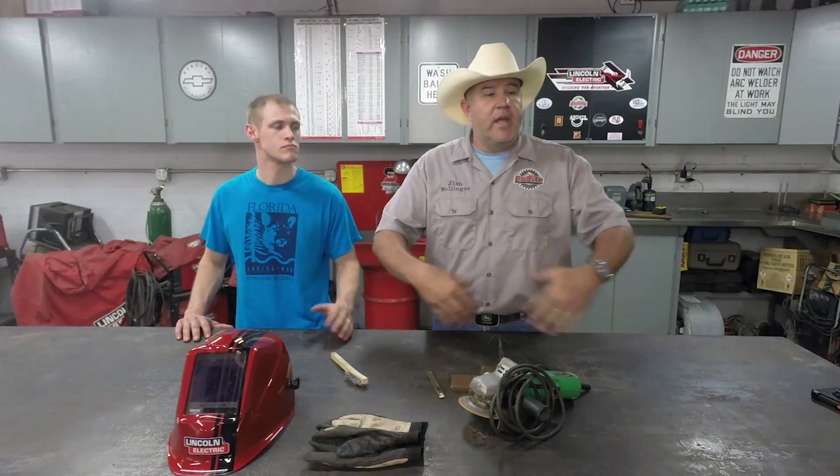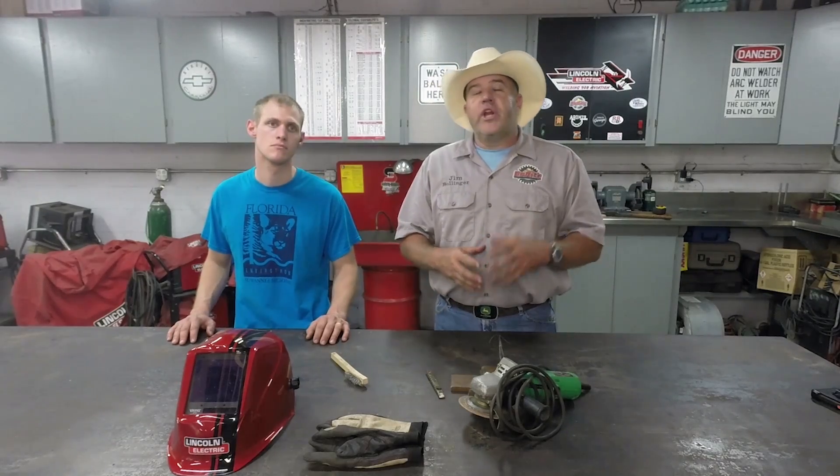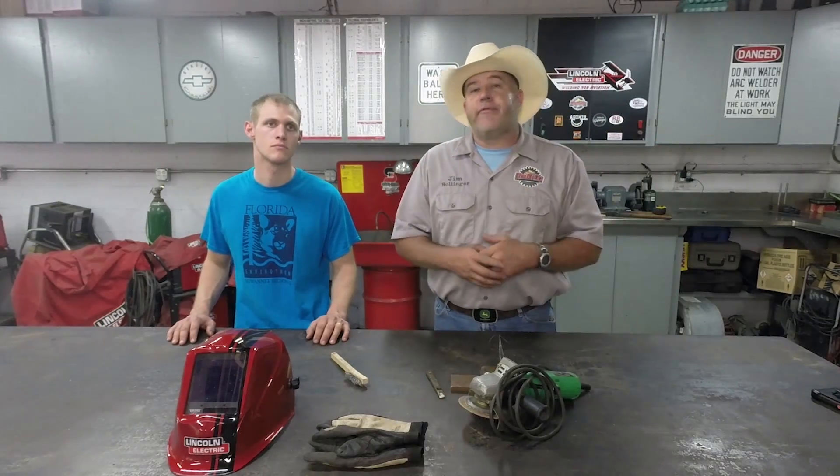The way we're going to remedy that is we're going to take that boat hull and either turn it on its side so that the argon hits the floor and dissipates out into the atmosphere naturally, or we're going to use a fan to change out the air inside the boat hull and allow it to be replaced with fresh oxygen. So when we're welding, if you hear a fan running and the audio gets a little rough, be patient with us because we're just trying to keep it safe.